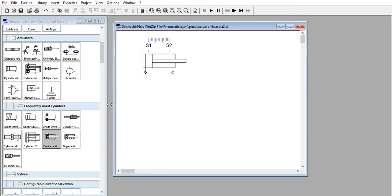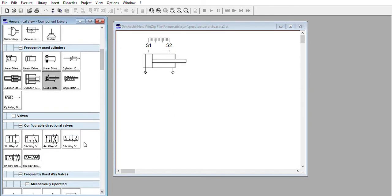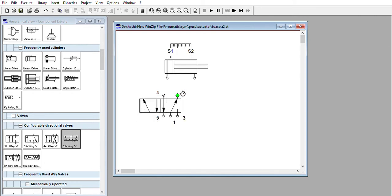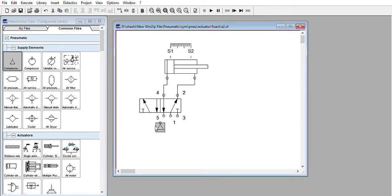To operate this double acting cylinder, we need two 3x2 valves, or we can use a 5x2 valve. In a 5x2 valve there will be 5 ports and 2 positions. These two positions will be connected to this one. As this will be a power source at the initial stage, we will give this input here. Always keep in mind that the last stroke should be in retraction, because your piston will be in the inner side position. Now we need a power source — a compressor from which you will get compressed air.